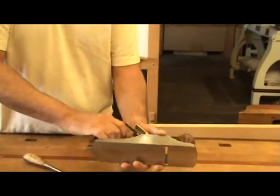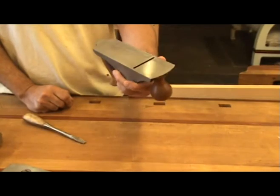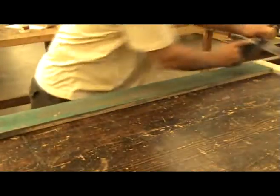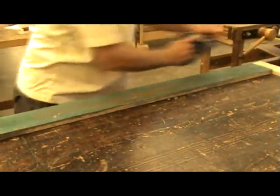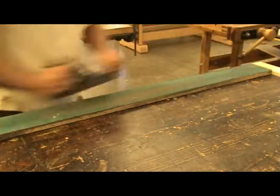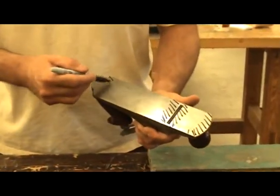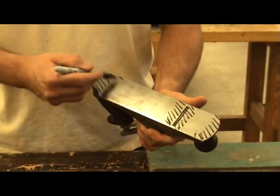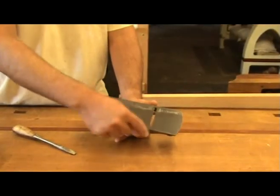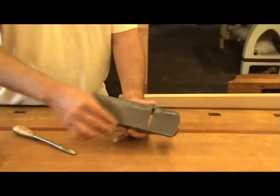The last part is the main casting. There really isn't anything to do with this part other than make sure it is flat. To do this, run it across a flat surface with sandpaper attached to it. Make sure the plane is fully assembled with the blade retracted. You can use a marker on the bottom of the sole to know when it's flat. When flattening the sole, the most important parts are the front edge, just in front of and just behind the mouth, and the heel.